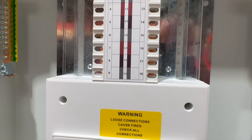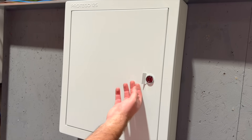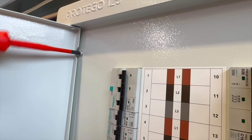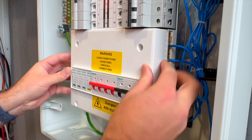And we're going to be doing that with the Protego 125 three-phase distribution board from Niglon. It's built to BS EN 61439-3, so straight away we know that it meets the requirements for low-voltage switchgear assemblies. And it's actually a really well-thought-out board, but it's going to be no good if the terminations fail.